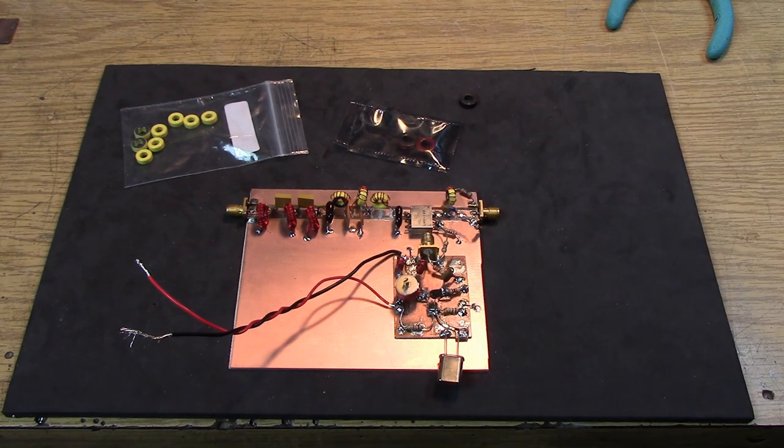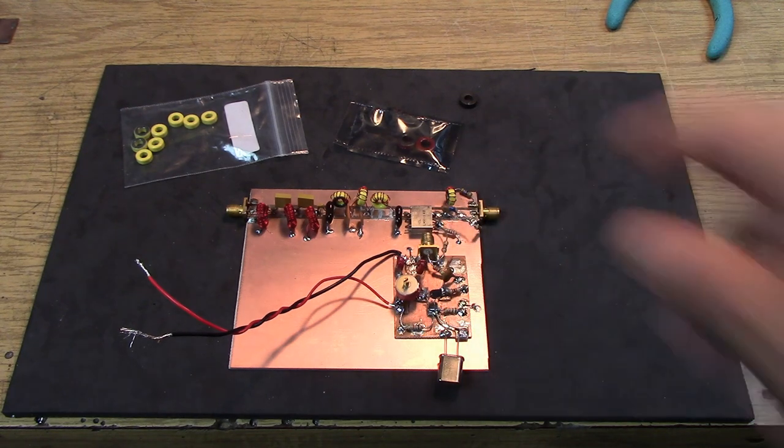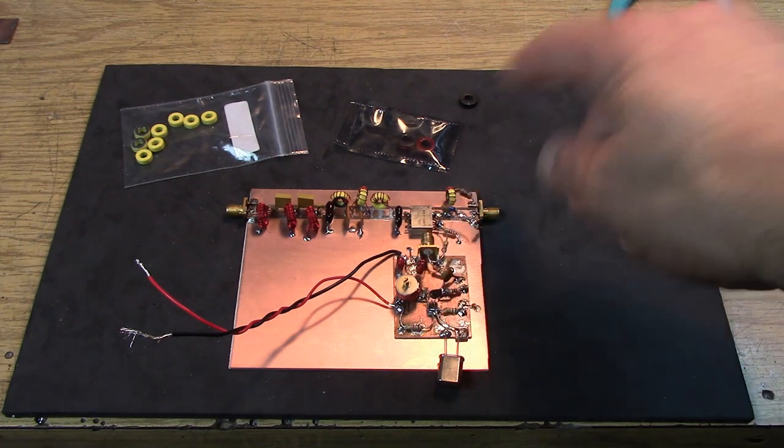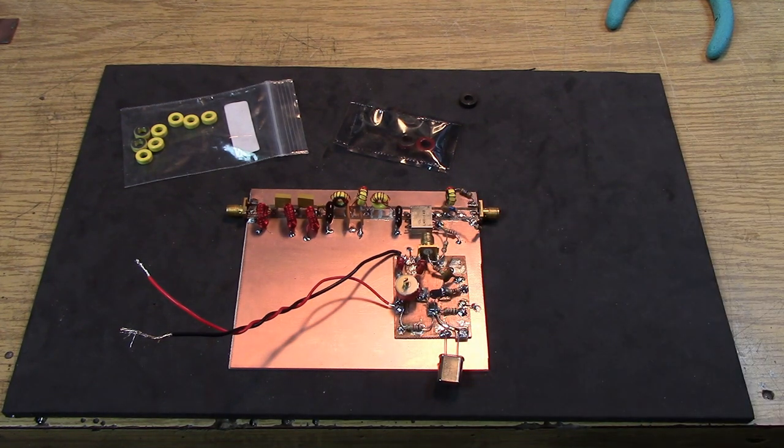And then on the output of the mixer, I've got a wideband diplexer. And why do I say wideband? We're trying to pass a fairly wide bandwidth because this is a block up converter. So we've got 30 megahertz to pass. So I'm kind of using a softer diplexer. I have a coil feeding a, well, it's a 47 ohm resistor, but call that 50 ohms, that handles the termination at low frequencies down in the shortwave band where we don't want that stuff leaking through and we want a good termination on the mixer. And then on the high side, I have a capacitor feeding another 47 ohm resistor that handles everything well above the 70 or 80 megahertz that we're handling.